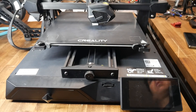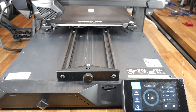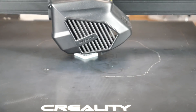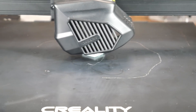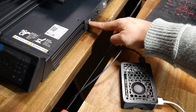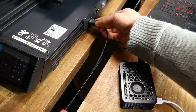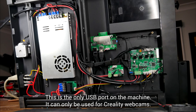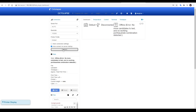The power-up protection did seem more promising — the machine detected the power cut when switched back on and offered to resume the print. But remember, these glass beds self-release the model when they cool, so by the time everything got back up to temp, it was inevitable the model would be knocked clear. And this last one is a real deal breaker: the port on the side can only be used for a webcam. We know from inside that the port goes to the Creality box, and the main board's USB port is also connected to the Creality box, which means there's no way to connect to Octoprint, PronterFace, or any other terminal software to manually control and configure the printer.